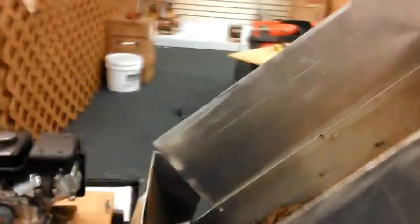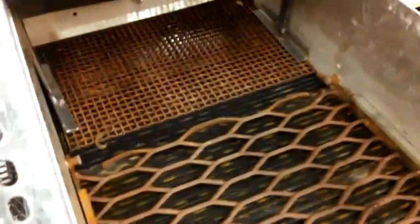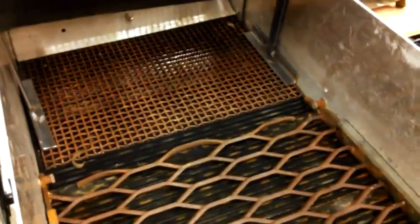The header box coming in — this I know works well. I have about a 3/8 grizzly. Washes everything real nice. The bigger stuff comes off the front, then down through the box. Up front I was having a problem with it buckling up from the water coming in from the crash box, so I put that grizzly in there with two little braces to hold that down.